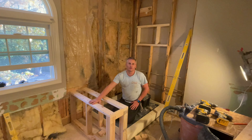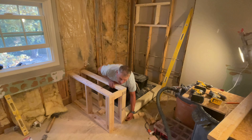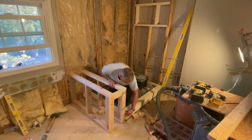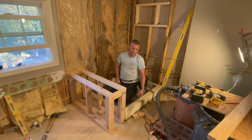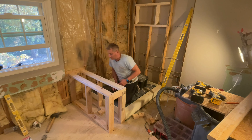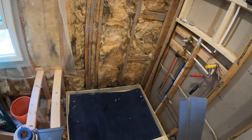The bench is basically framed out. As you can see, it's about 14 inches of total bench — right now it's around 12 and a half inches, then you add two inches for backer board and tile. I will tile all of this. I have about a half inch gap that goes up to about three-sixteenths of an inch, which is fine because I'm going to keep this vertical. Tile Ready has bevels on a lot of their bases, but we're not going to use the bevel — we'll keep it vertical so I can finish the tile along here.